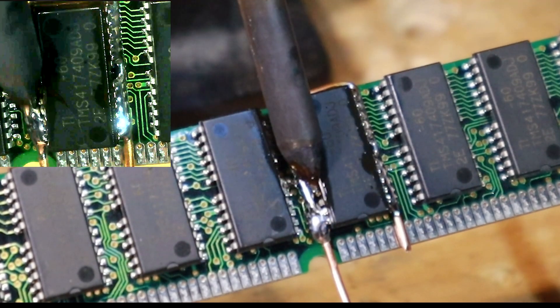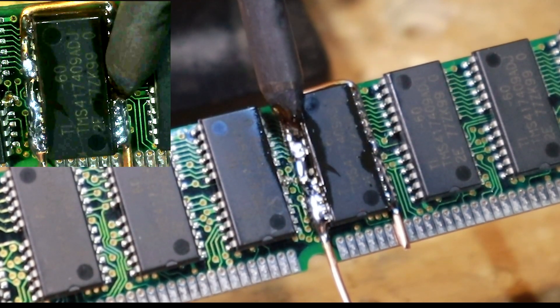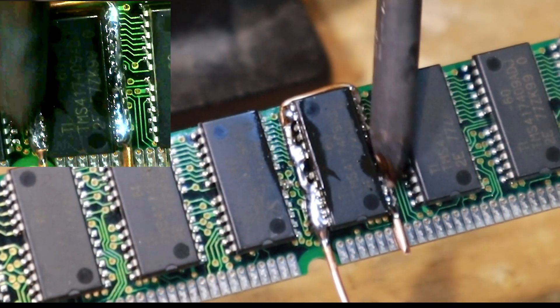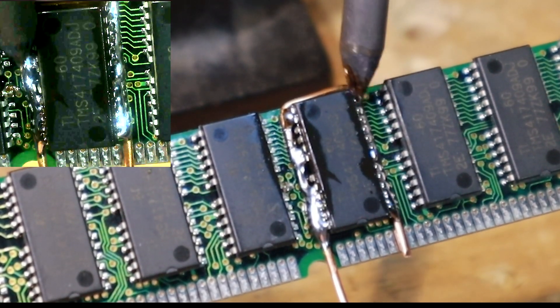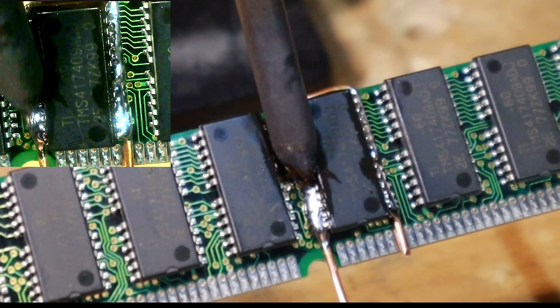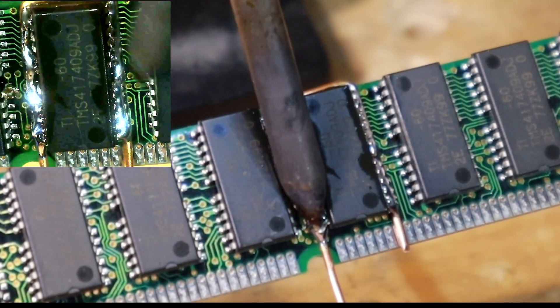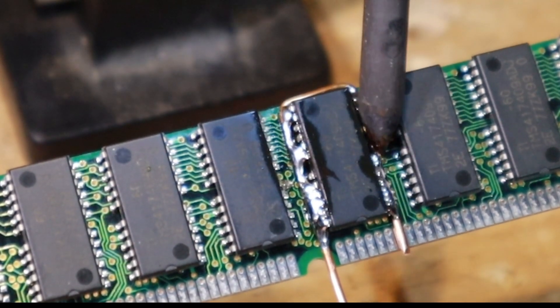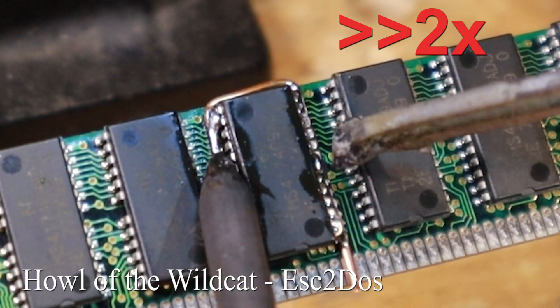The other side has already solidified so I've got to go back and forth. Everyone has tried this at some point — running the soldering iron back and forth to remove an IC. I've tried it a million times and it's usually awful; you usually end up burning the traces in the process. I've got my soldering iron set to 350°C and I'm giving it all I've got, and it just doesn't want to budge. I've made a mess of this board at this point.